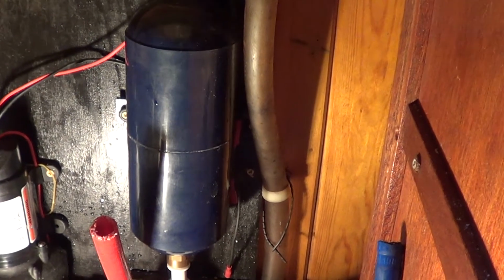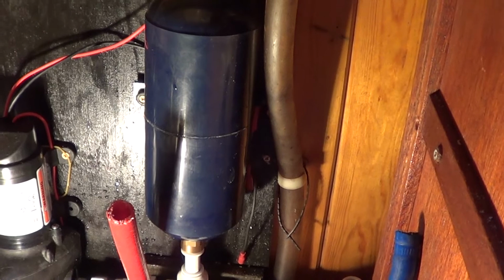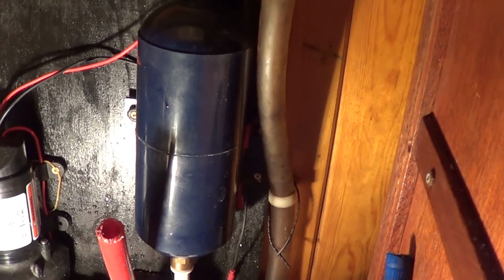I might just try those two wires. I know where they are in the panel at the back there. It's not far. I'm going to pull the whole cable. It goes to a chocolate block, a horrible joiner, and then it's like household cable that's been used, and that has a tendency to break. It shouldn't be used on boats, and it should be flexible, copper stranded. So we'll change all that.